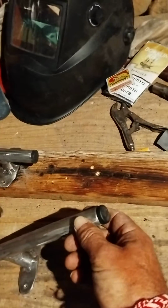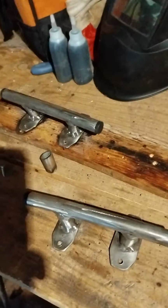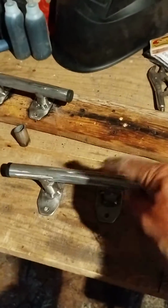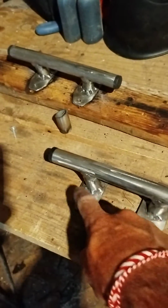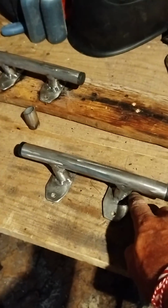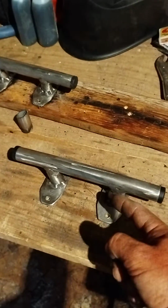1.5 by 1.5, that's the material, that's the pipe. So it's a 1.5 thickness, the wall. This is a 3mm plate, 21 centimeters long, welded all around. But down here I just tacked it on, 6 tacks going around, because you don't want to burn the pipe. If you make a non-stop weld, you're actually weakening this pipe and it may snap above the weld.